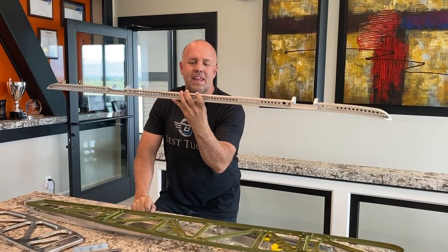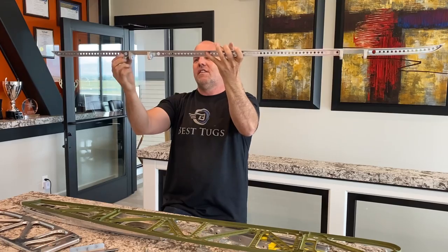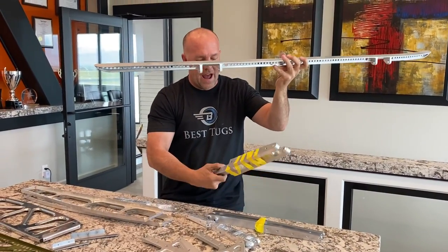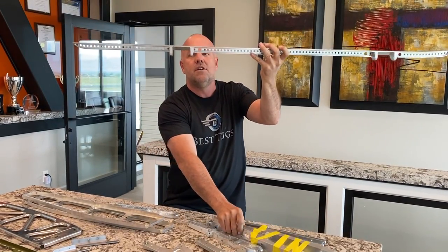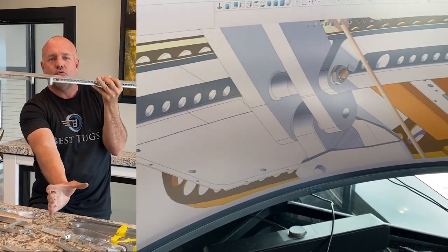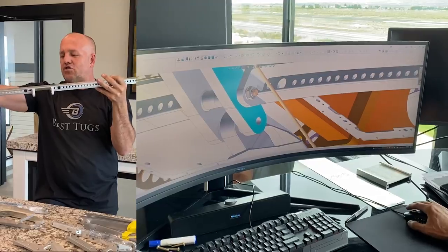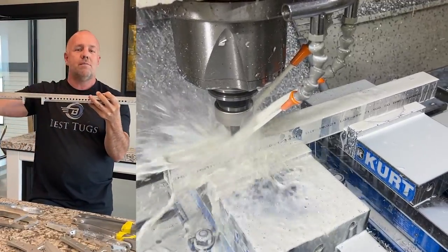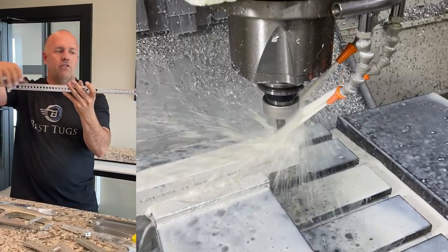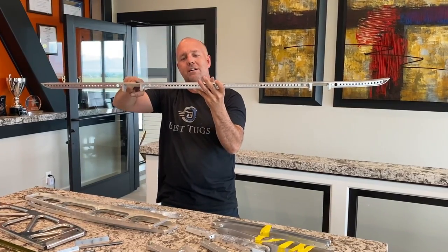This is a mini I-beam with my tie down points to tie down the airplane in the wind, because it's the strongest point. This is where the strut brackets come up through. So where this bolt is, directly my front and rear struts, is the strongest part of the wing. It's where my strongest extra heavy duty rib is. And then I'm going to attach this all the way down the skin of the wing to the heavy duty reinforced rib that is a truss web.